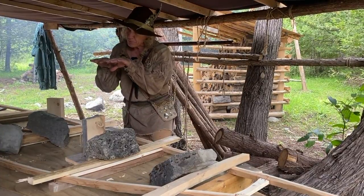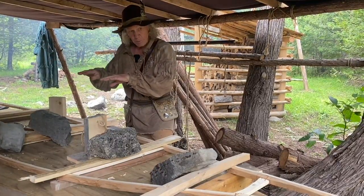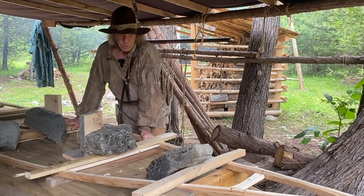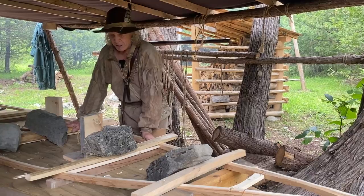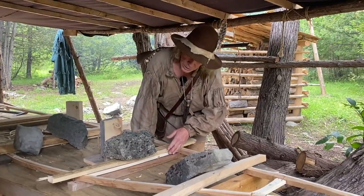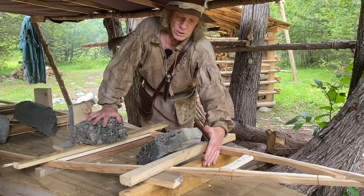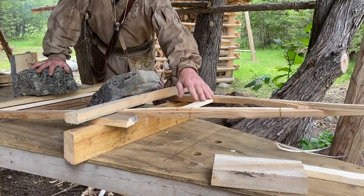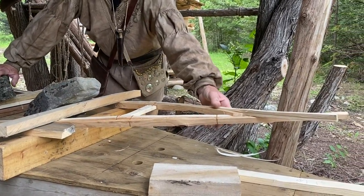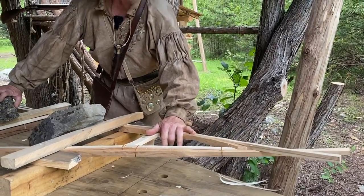So the shear line, if you think of it, if your canoe's sitting upright on the water, the shear line is the shape or the profile from bow to stern of the side lines. And this one's going to have quite a bit. That's the way the Algonquin built theirs, especially their smaller hunter canoes. So I've got the center thwart done, which sits right on the platform. I've added 1 inch here, which is starting to bring my shear line up. I've added 4 inches here. Using my measuring sticks, I'm going to carbon copy that at the far end. So I've started there. The one part I haven't finished yet, that's where the boiling water comes in, is I've got to steam these guys in order to get that final bend in the end pieces. So back to the other end.